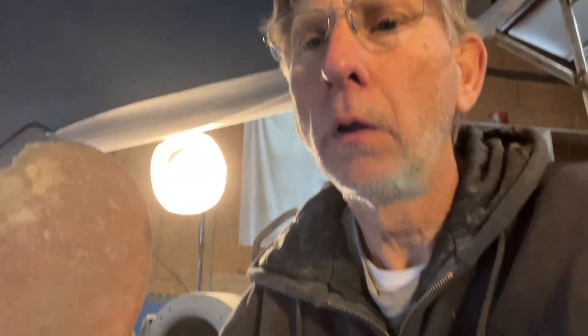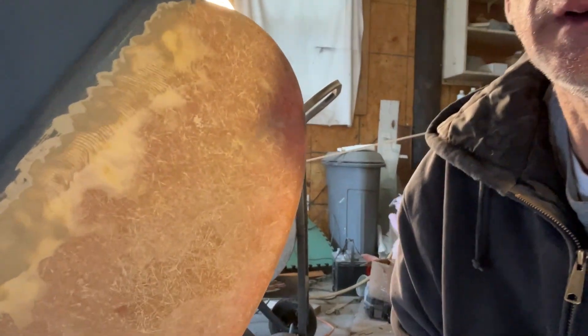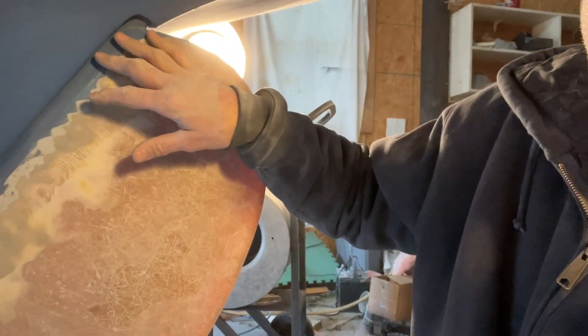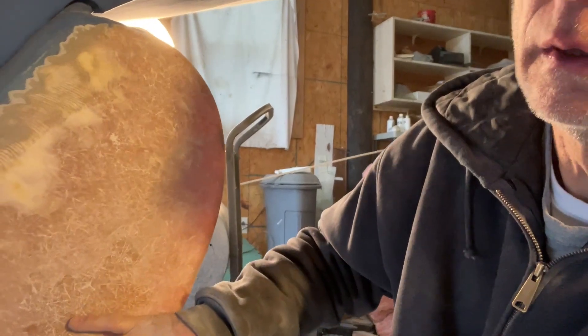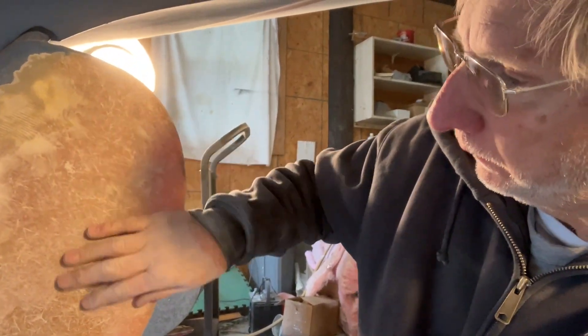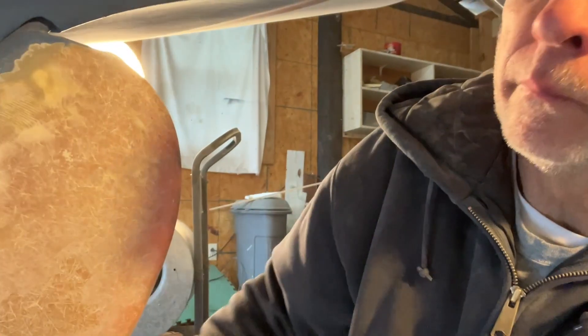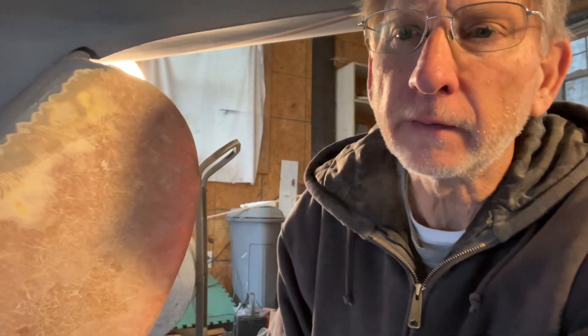Fortunately the leading edge didn't seem to have any problem at all, so I basically just sanded up fairly close to it. The front third of the rudder had no problem, no issues. The problem was in the middle and here on the trailing edge. But I've ground it down where I can feather it back in with some fairing compound. I didn't find any blistering at all in the fiberglass and the resin — it was just between the barrier coat where the barrier coat didn't bond. I've got both sides cleaned off like that.